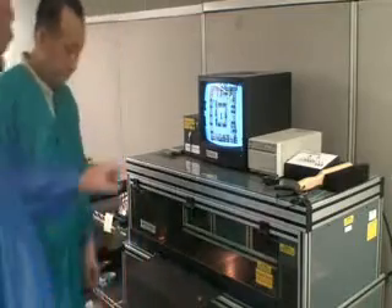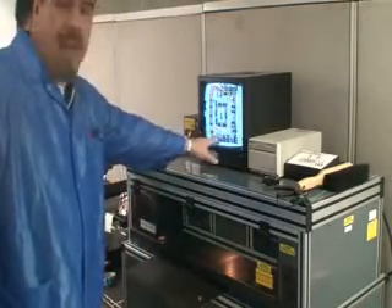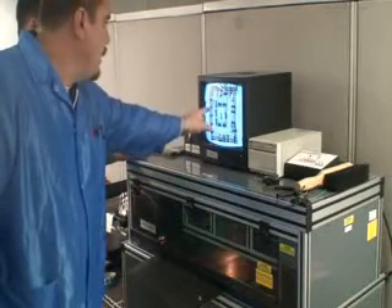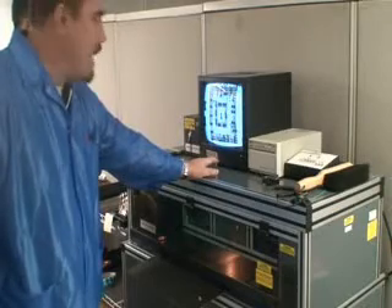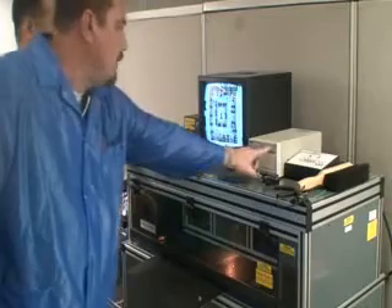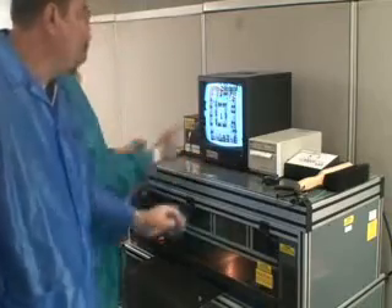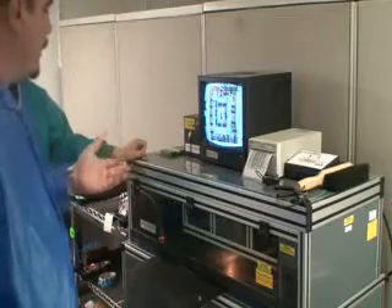During x-ray, what we're looking at here is a picture of the package-on-package — the OMAP and the memory device. In these areas, you can see capacitors underneath the device on the opposing side of the board, of course. At this stage, we can also take a picture of what we're looking at and use it as a comparison for whatever run we're doing at that time.